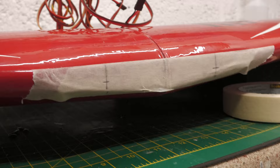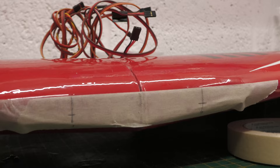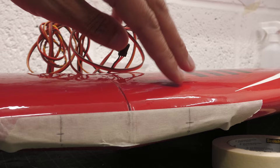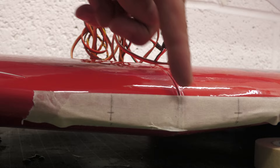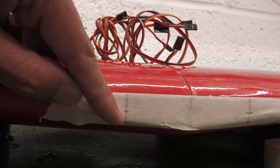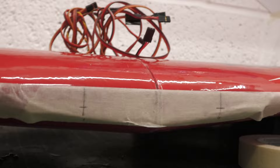Let me show you what I've done. I've put masking tape along the front edge of the wing just to make it easier to mark. I've lined the top piece of the masking tape up with the top of the wing — quite difficult because there's a curve then it goes flat, and I'm trying to get it on the flat edge. I've then measured from the centre 50mm out on each side, giving me a 100mm gap, and down each line I've done the 12mm. So those crosses should be the dowel locations for the wings.